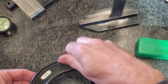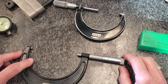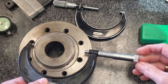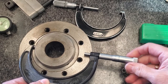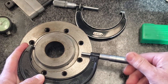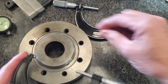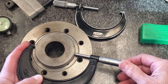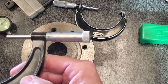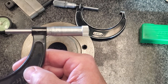I've got my 2-3 and 3-4 inch mics to do some checking on the lathe back plate and the adapter. This is a D1-3 backing plate insert that was on the Buck chuck, and it definitely had a light press fit — maybe a half-thousandths interference with the chuck body itself, so I definitely don't want to go any bigger than this. I've just checked these mics against gauge blocks so they're reading dead on. We're at 3.100 and about a half thousandths.